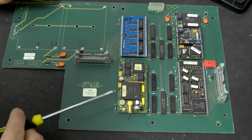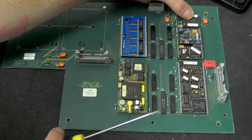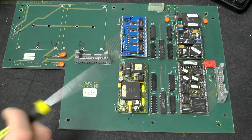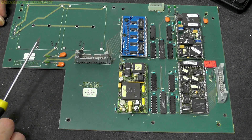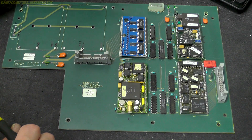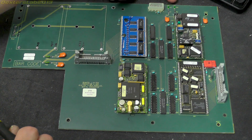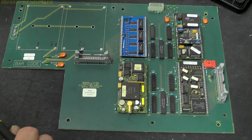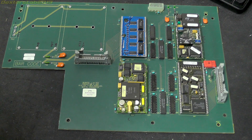The two significant chips on here are the STMicro STV1602A and STV1601A — not surprisingly, serial to parallel and parallel to serial converters. Up on the top there's another Molex connector that plugged into a small fan to cool these down, because they do actually run quite hot. There are also a couple of status LEDs for plus and minus 5 volts — if they're not lit then you've got a problem on one of your power rails.